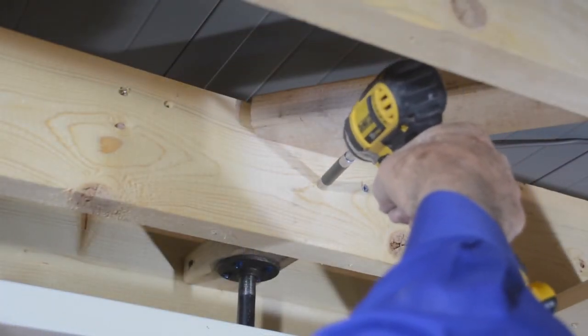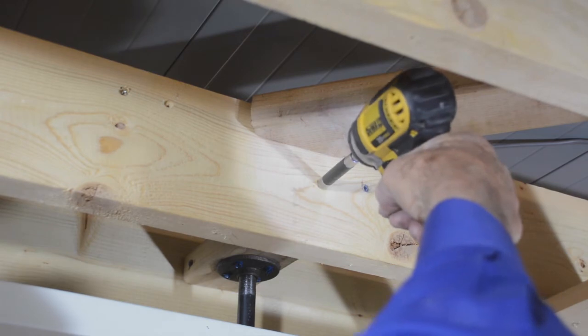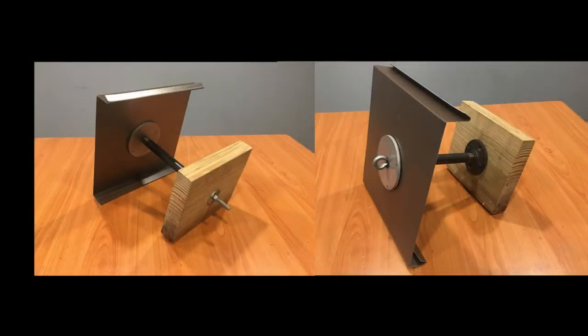And a fourth screw through the joist into the mounting board. Swing mounts are installed similarly to fan mounts, the exceptions being that instead of an electrical wire passing through, a heavy eye bolt with a washer and nut above the support board is used. Since the swing mount will be subjected to swinging back and forth, a wider support board is used with wider spacing of the screws and possibly more of them.